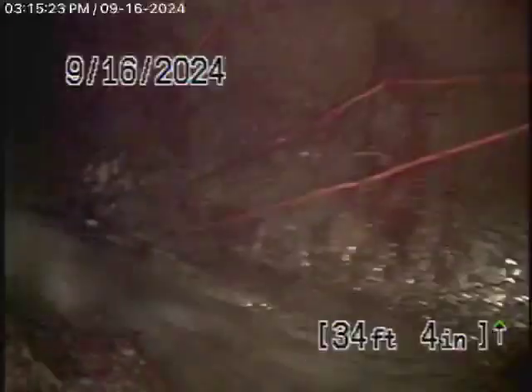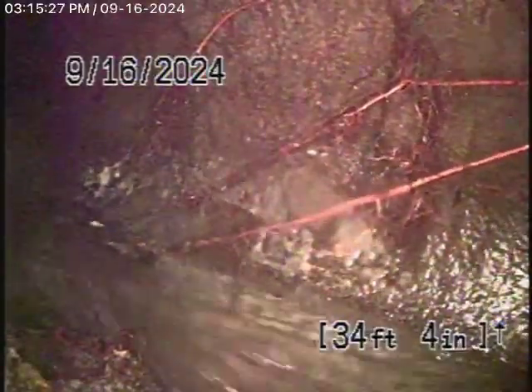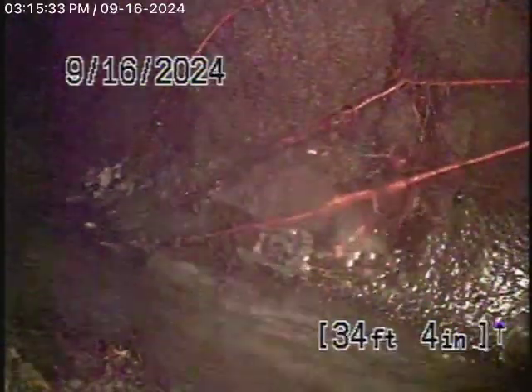It's all ABS plastic coming back — it's all in good condition. As we come up out of the cleanout here in the front, we'll pause the recording again. Running the camera from the 4-inch cleanout at the property line, we're all the way out into the city sewer. You can actually see the city sewer flowing by. In fact, the city sewer has roots in it.